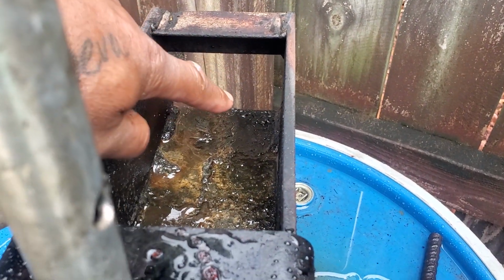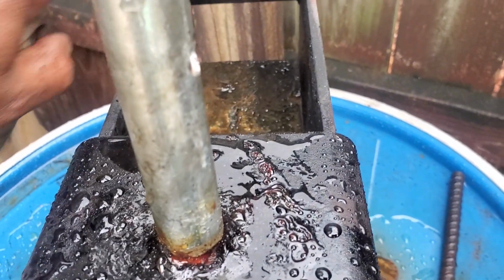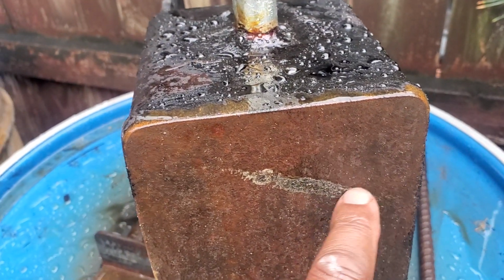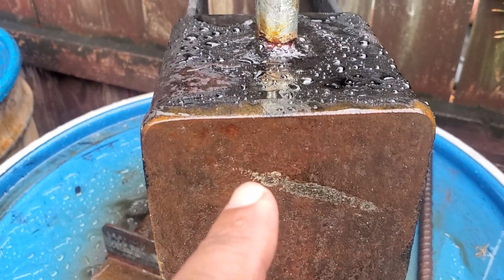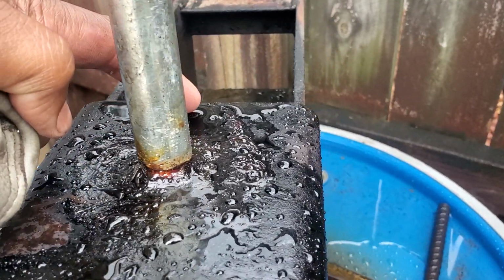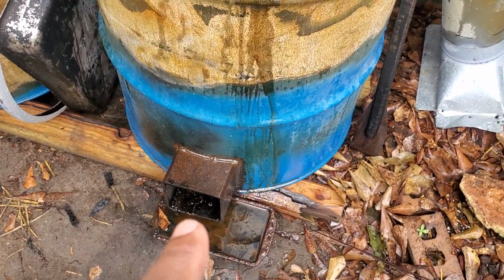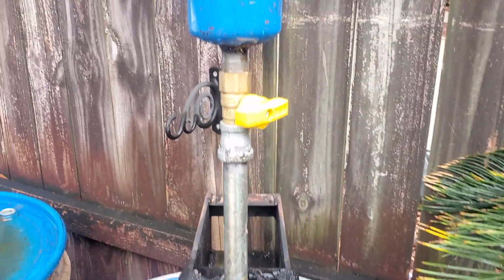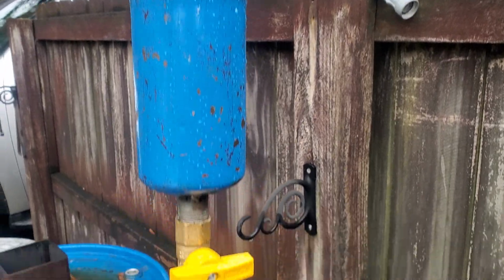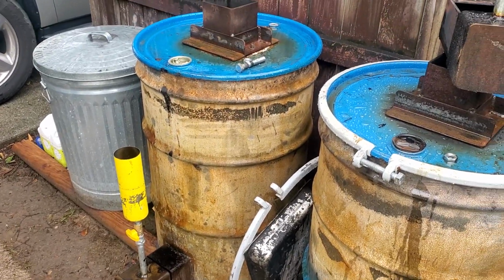We're going to now, again, weld a flat piece across there to make basically a swimming pool. Still have a space for the flame to go through. And on this end, we'll cut the airflow. So, air will come in through the back, travel across the flame and the wicking material, through and out into the riser, and of course heat up the riser tube. But that's a waste oil burner, guys. Basically all you have is a controlled grease fire. That's it. And once it's all done, your setup will look like this.